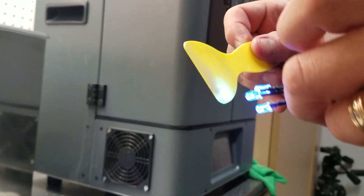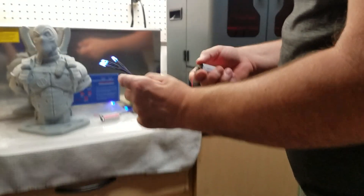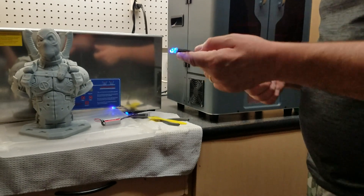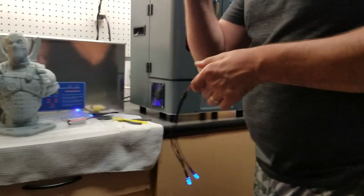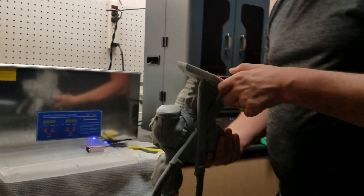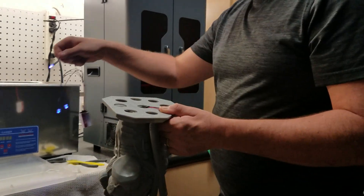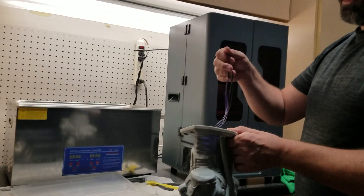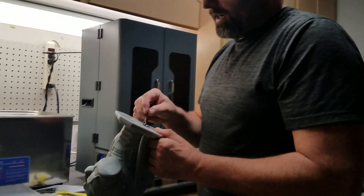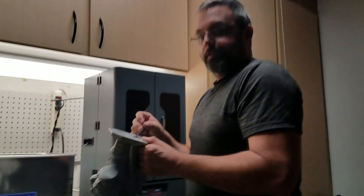So that's what I'm doing to cure the inside of these prints. I went to Amazon and bought a bunch of five millimeter and three millimeter LEDs, wired them up to simple nine volt batteries. I got that tip from another YouTuber. My buddy Omar recommended a dental UV light for curing, but unfortunately that light doesn't get into the little tiny prints. For the small stuff I decided to go with LEDs and they seem to be working pretty well. It doesn't take long — about 30 seconds to a minute on the little prints. For this big guy I'll spend a good amount of time making sure I get light into all the different areas so it's cured and doesn't crack later.